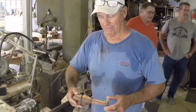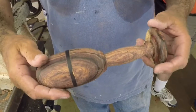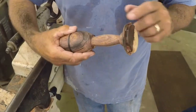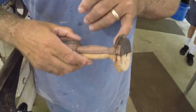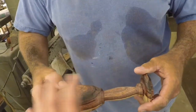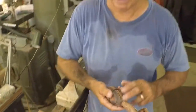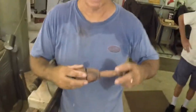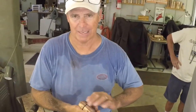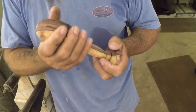What's next to get it finished? I've got to finish sanding it out — it's still got some scratches in it at 120 grit. This is dense wood, so 220 will almost shine it. Then in this particular case, I'll wax it with a safe wax. I'll cut this piece off on the lathe. When you're sanding, you always have the marks going this way — at the very end I'll go with 320 and hand sand in the other direction. All the rest of the sanding will be done on the lathe. That 320 will take any scratches out before you put a finish on. If you leave the scratches in there, even though they're subtle, as soon as you put finish on it they're not nearly as subtle.